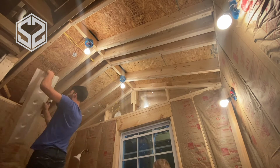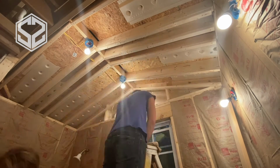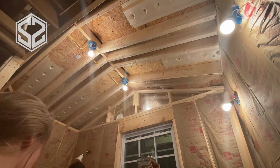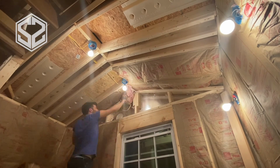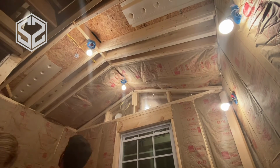So I'm also adding in the styrofoam spacers on the edge of the roof. If you try to cram the insulation up there, it will squish it together and touch the roof. So that's keeping the insulation away at the bottom, and this will give it plenty of ventilation. When the sun comes out and condensates all over the roof, it will dry out because it has plenty of ventilation to vent up through the ridge cap and escape out the top of the roof.